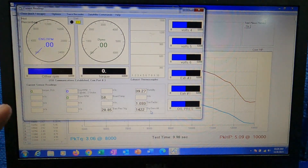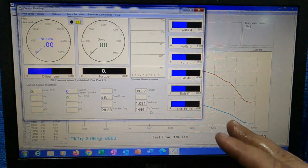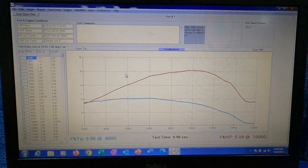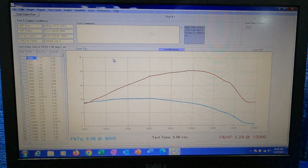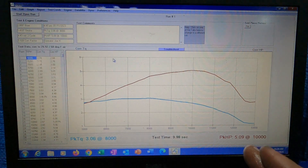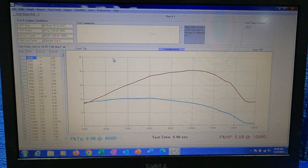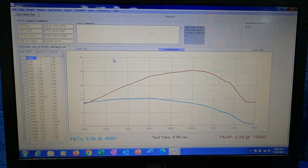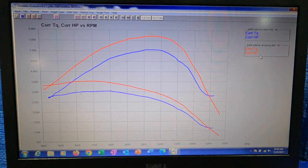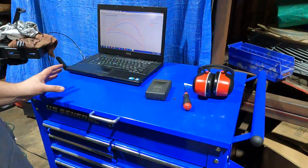Same with the dry density altitude. The only thing we change is our gear ratio — if we have a saw come in with a six-tooth sprocket we adjust so the RPM pickup reads the same, or if a saw comes in with an eight-tooth, we can adjust the gear ratio so engine RPM matches dyno RPM. We can put up to six lines on the graphs and change all different colors. Those familiar with the channel know what these graphs look like.